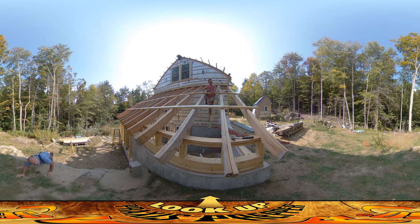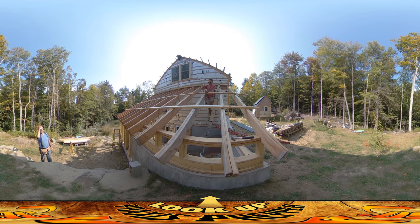That's all I'm going to talk — the rest is going to be really novel for this series: me actually working and doing something. Which one am I going to do next? Right hand, okay this one here. There's no drama, nothing needs to be changed. We had some fighter jets fly over two seconds ago — that would have been dramatic. Every one of these where it crosses gets two nails, diagonally across from each other into each rafter near the ends to keep them from splitting.